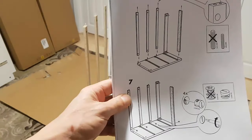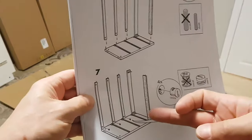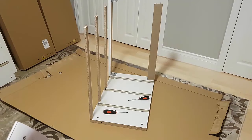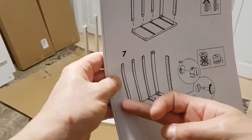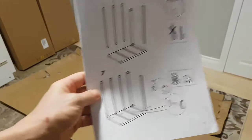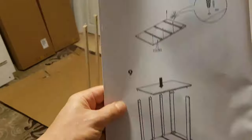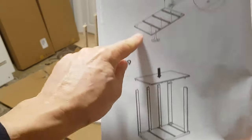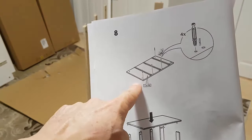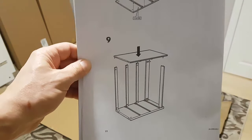We've completed that step. The configuration is assembled — just be careful that the hole for the turn fasteners is on the back side. All three turn fasteners get screwed in using a flathead. That's all done. Step eight is to take the other large piece, which goes on top, and install four pins, screw them in, and then put it on top just as shown.